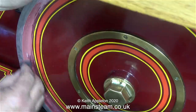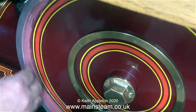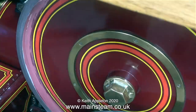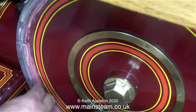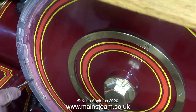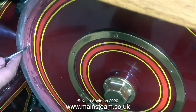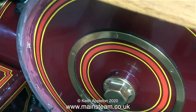This quite obviously is the flywheel and the paintwork around the edge of it was very badly damaged. The paint was so badly damaged that I removed it in a previous episode. The paintwork on the flywheel was also damaged around the inside edge. Repairing the paintwork in this area is proving to be more difficult than I first thought. Initially I removed the loose flaking paint and then I used a thin skin of cellulose stopper or cellulose putty to fill in the blemishes where I removed the paint, and that's when the problem began.